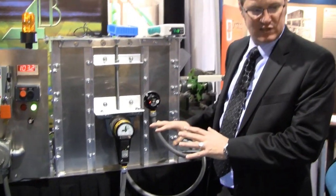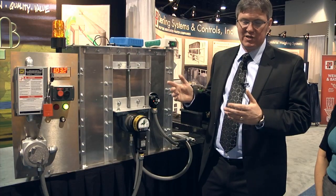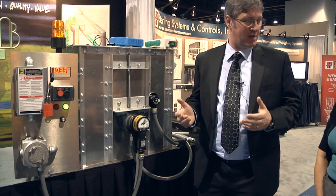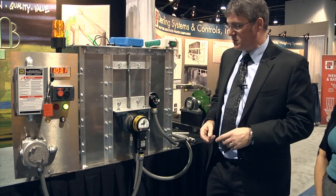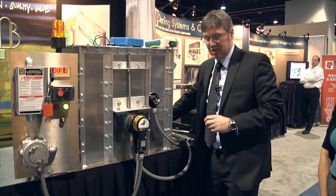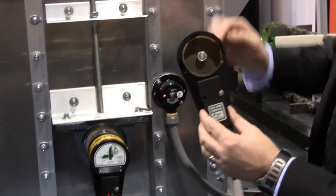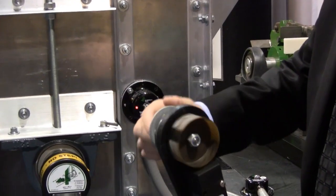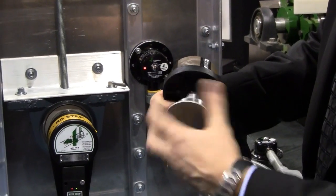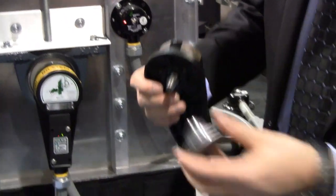I can first show you how that is set up and how it's calibrated. It's going to monitor the shaft speed of a bucket elevator or a belt conveyor, so if the belt started to slip and the shaft started to slow down, at 10% under normal speed we will get an alarm, at 20% below normal speed we'll get a shutdown. Here we have the M800 speed switch installed on a whirligig on the shaft. Inside the whirligig there is a target — it's actually got four targets on the device — and as the shaft turns the sensor picks up the targets through the cover of the whirligig. The whirligig is mounted to the machine shaft by drilling and tapping the shaft and mounting with a half inch UNC thread or you can use the optional magnetic coupler.